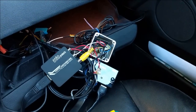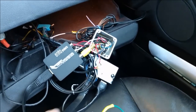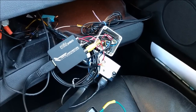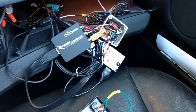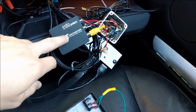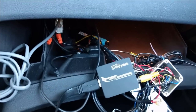And the way it works is the MCU knows that I have a signal from my camera. It just reads the analog input, and then it also reads these LED states, so it knows exactly in which state the HDMI switch is right now. And if it's in the wrong state, it just switches it by emulating pushing this button. So I had to create a small PCB with transistors to do this kind of stuff. And I'm also controlling power programmatically, because this guy consumes like 0.5 amp, which is quite a lot. That's why I had to use another power supply here.